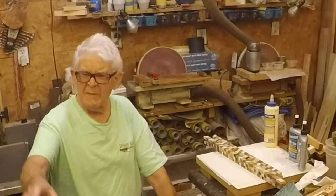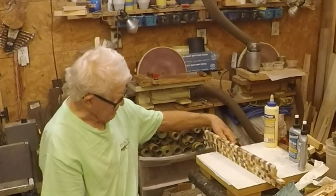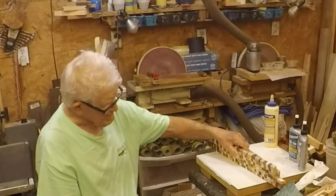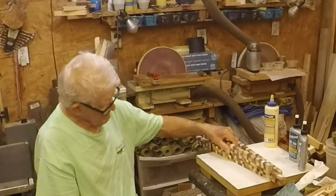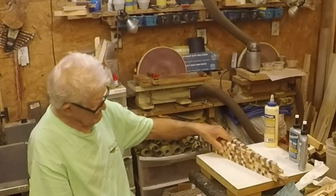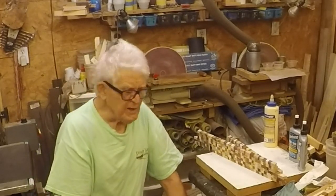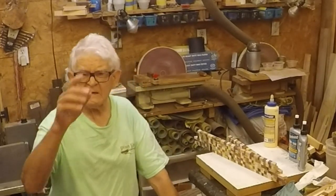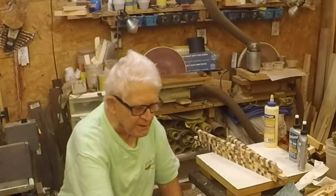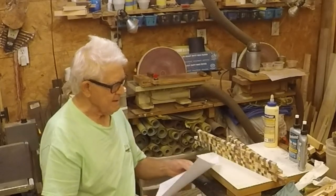So I'm going to make 6-inch rings, 2 of them. Don't make it that tall just for the rings. Of course, I'll have to put a top ring on them. That's pretty tall, 2.5 inch. So I'm going to use, I think, 24 segments. I was thinking 20, but I think I'll go 24, a little bit smaller segments. Give me a little bit better look, maybe.